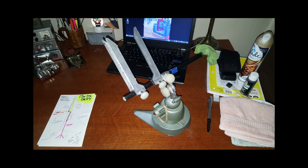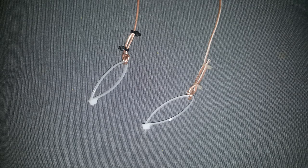And so let's get on to the antenna. Here's what I dug up around the house. What I wanted was a 17-meter vertical, but I wanted one with really good performance, which means I needed to elevate it off of the ground. Otherwise, I'd have had to lay down a reasonable radial system. And also, I want a portable antenna. I want something on a tripod you can throw up and stick a few tent stakes in the ground for support, and there you go.